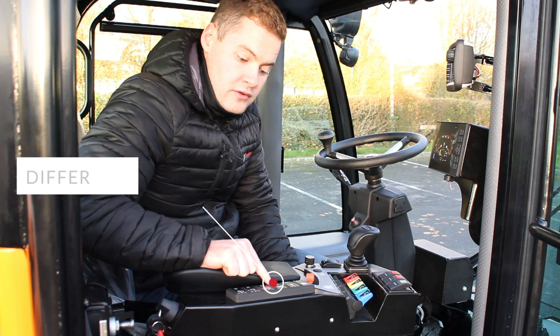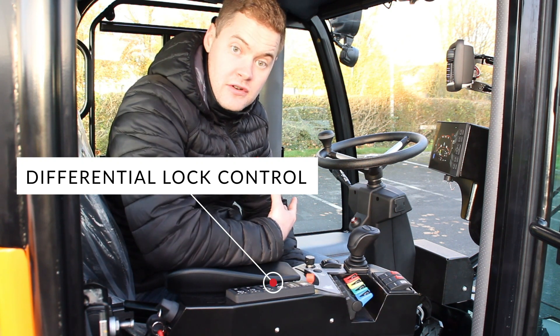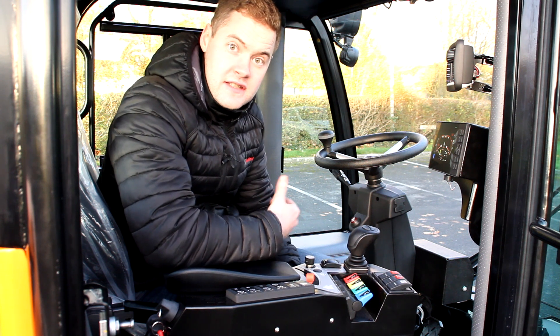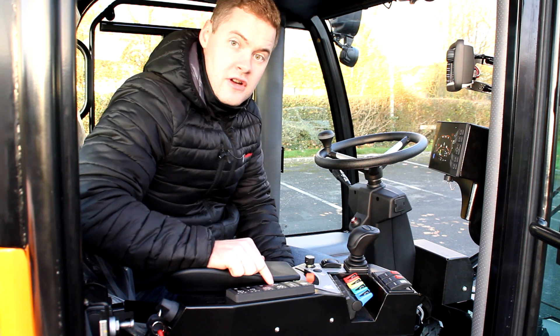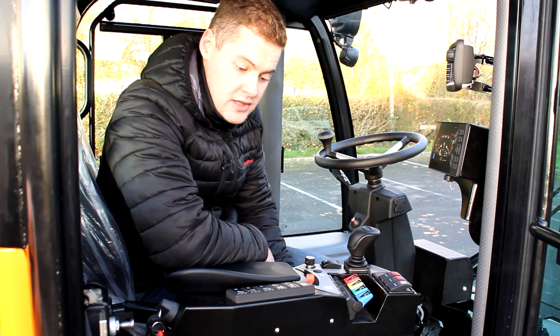You have control for your differential — you'd need that for heavy duty winter maintenance. On the MX you actually have a two-stage differential: stage one gives approximately 50% lock, and then stage two gives a full hydraulic lock when engaged, providing super traction on the machine.